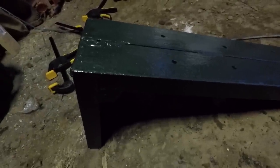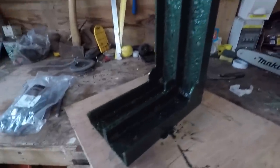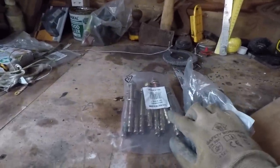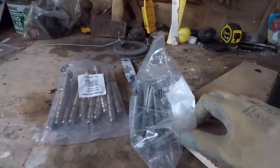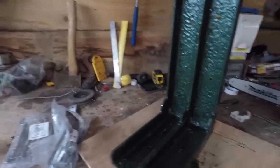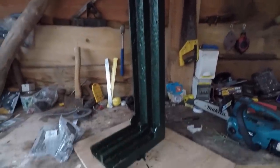Tomorrow might fit it. Okay, morning time. Bracket's done. Dry, missed a few spots but I'll touch them up afterwards. So gonna get these flipped down. I've got some fixings, to fix that down to the concrete. I've got some stainless steel bolts because it's going into oak, and oak will rot anything other than stainless steel. That's why this has been painted, to hopefully prevent that from happening. But this will be changeable if it does rot out in the future, so it's not going to be a problem. Okay, let's go and get it fitted.